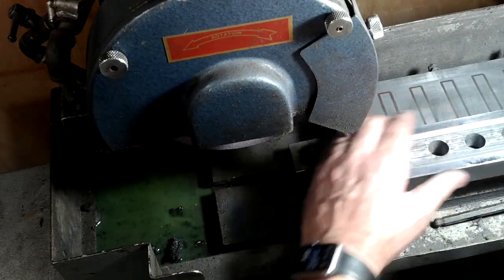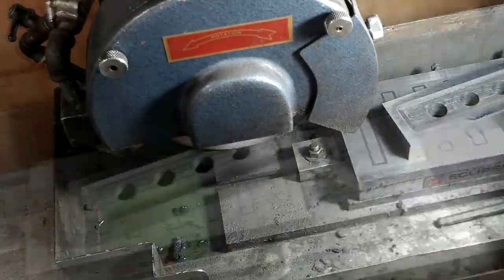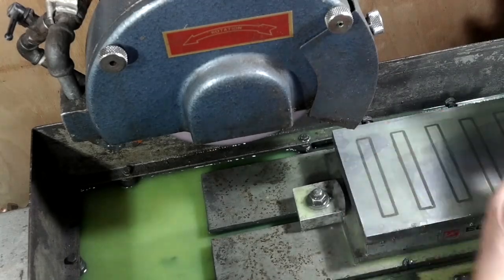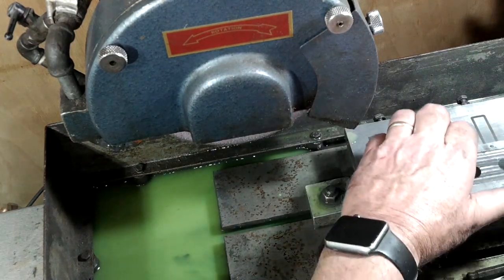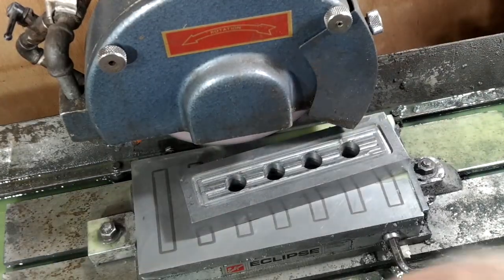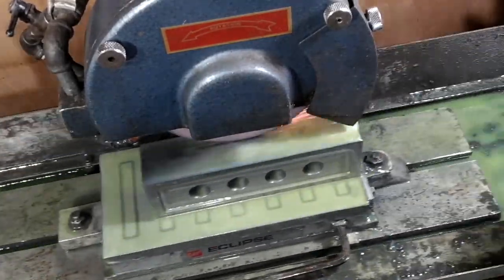Now for the exciting part. Before I went too far with this material I let it rest for a few days — the truth is I had to go and do some gardening before I could carry on. I've decided to clean up the side faces first and then concentrate on the top and bottom faces. The problem is that the material isn't flat, and if I put it directly on the magnetic table and turned it on, it would pull the material and the top face will always be wonky. Instead I used the magnetic chuck's end stop to stop the material being pushed off the end, and I used only residual magnetic energy to hold the material on the chuck face. Once that top face was done I could turn it over and hold the material on full chuck power to finish. The same process was used for the most important faces — the top and bottom.